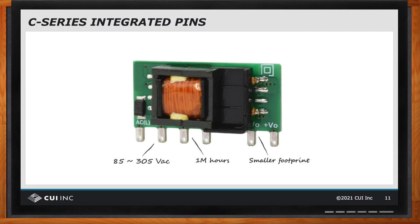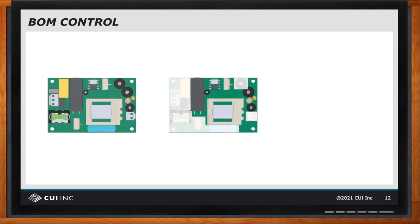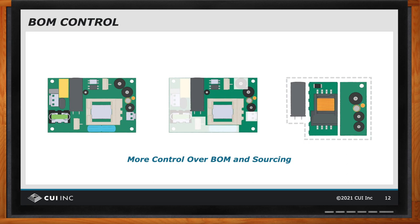Keeping your BOM under control is also a big aspect of power supply design. The flexibility of the PBO comes from giving the user control over a large part of the BOM — the design and selection of the EMC circuit as well as the input and output capacitors. Everything from suppliers, component values, and package type can now be chosen by the user. We're not talking about a couple of chip resistors — we're talking inductors, chokes, MOVs, and large electrolytics: components that have as big an impact on BOM cost as they do on form factor.